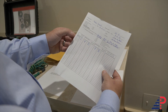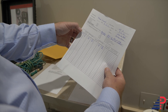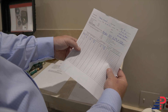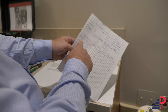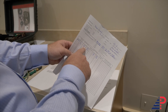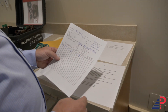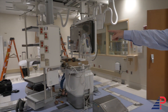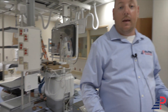You're also going to go room by room if you have a bigger facility. On the left-hand side write each room with what you're using: C for critical receptacles, G for general, the number of receptacles for each, and the number of 'other' — meaning floor duct, pedestal, bed, med gas equipment. Count all those up and it equals your total number of other.